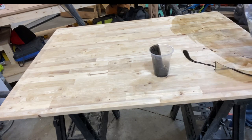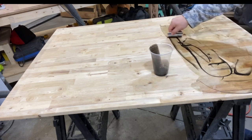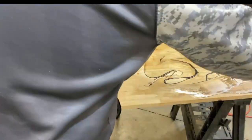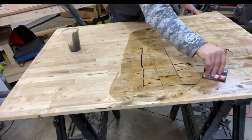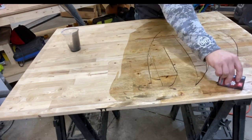the wood. To do so, pour a small amount of oil on your piece and start moving it around with some sort of card like I do here. I usually use a Bondo spreader, but I couldn't find it. I probably actually used it for Bondo and then threw it away. When working with Rubio, it's important to remember a little goes a long way.